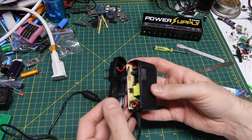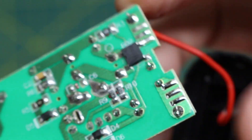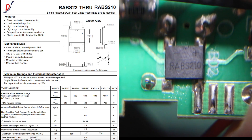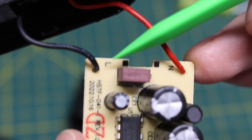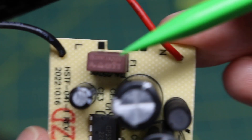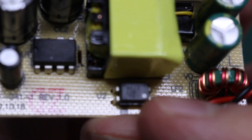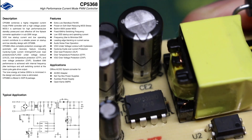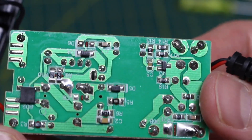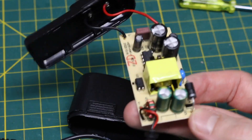So I got this finally pried apart with minimal damage to the plastic. The AC prongs are soldered directly on there going to the board. Output is 18 volts. AC comes in on the edges of the board. There's an ABS 210 going to a bridge rectifier — it has a plus and minus output. The AC line goes through an F1 T2A 250-volt fuse to the bridge rectifier. There are some filter capacitors, a transformer, and what looks like an optocoupler marked 817, which must be feedback to a switching regulator. There's also a 5368D and a component marked LF2 — a power filter. So this may be okay for some other applications but apparently not for powering audio gear.